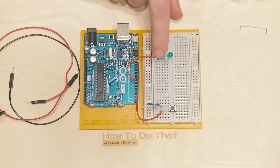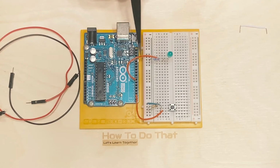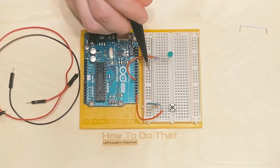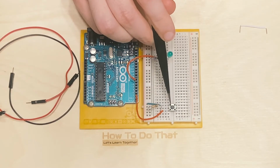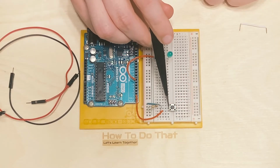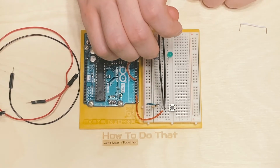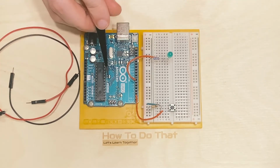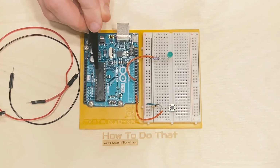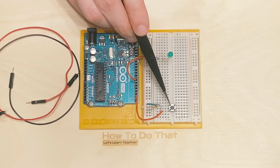So at this point, the wiring is done. We have a complete circuit here. We're going to have power being supplied from here, going into the LED, out through the resistor and into the negative or ground. And likewise, we have power coming straight from the breadboard to the button that, if it is pressed, will then go out through the legs, through the resistor, and we will also be detecting what the voltage is with this wire here. So now we can move on to the programming of this chip in order to control what this LED does, whether the button is not pressed or pressed.